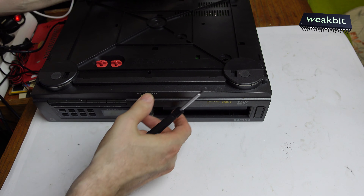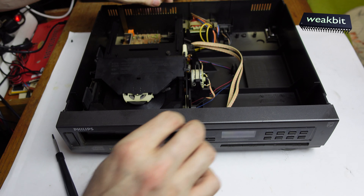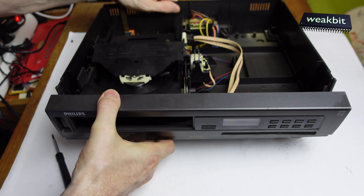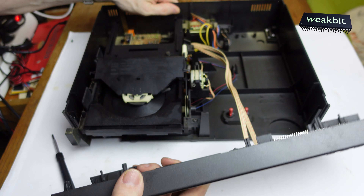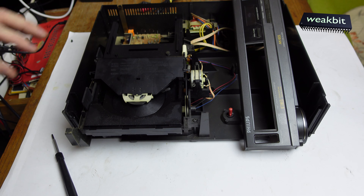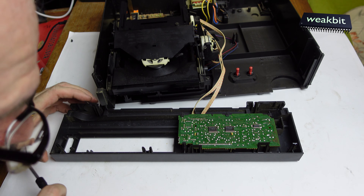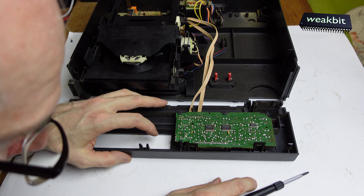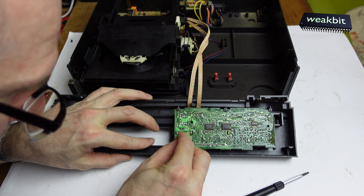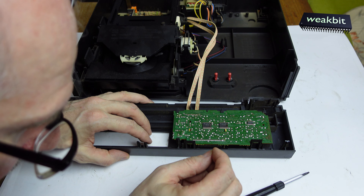We must shift it to the right. Here we go — we have this special front-end piece. We close the door and pull it over. Now we can open it — it sounds aggressive but it's okay. The first thing we're going to do is deinstall this part and clean it from the inside. There are a lot of cold solder joints visible.